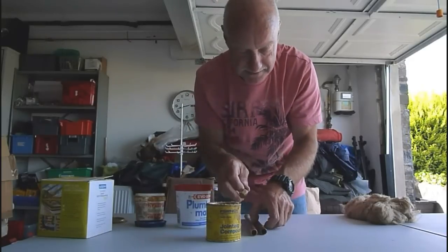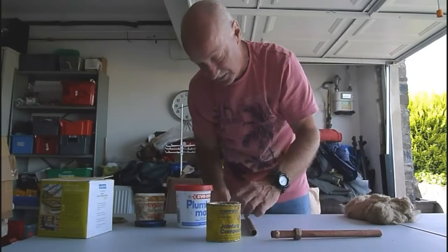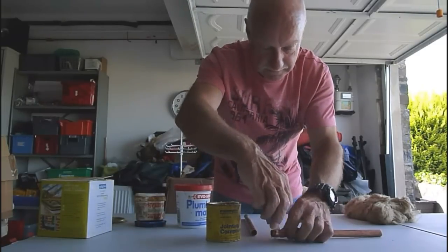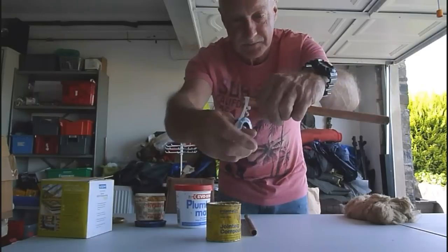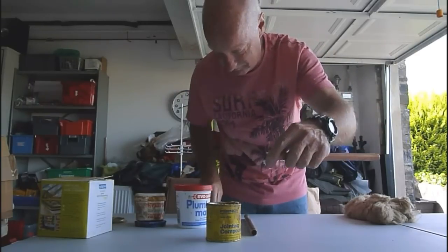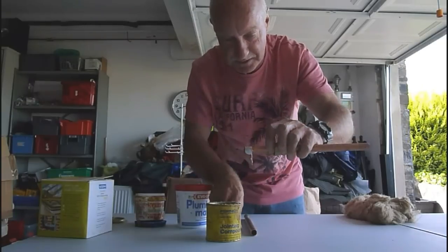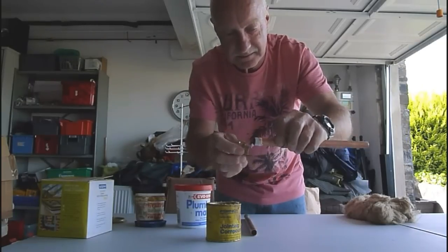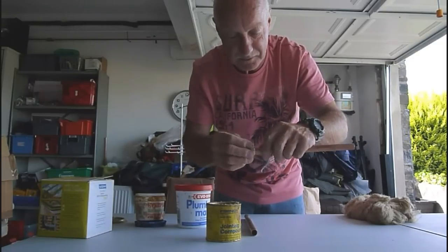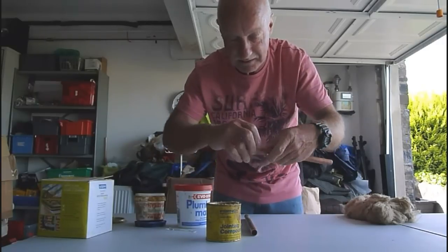Sometimes you're lucky and it does hold, but I guarantee you, if you use this stuff you won't get a leak — it's cracking stuff. Now, a lot of other plumbers use PTFE tape to join these — they put the olive on there like so, they get the PTFE tape and they wrap it around the joint like so. That's okay, not my preferred option, but it will hold, you know, it will do the job. Put it in and you'll find that does hold quite well. For me I prefer the boss white, but PTFE is the modern day option — I still don't like it, but there you are.